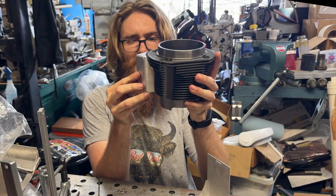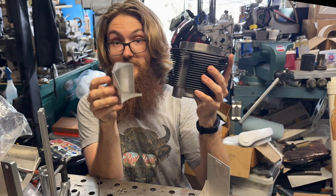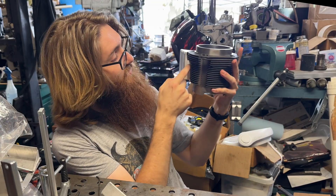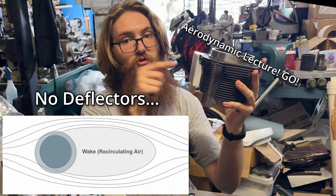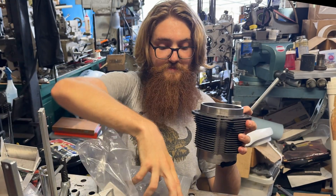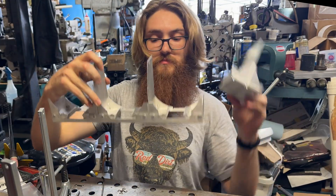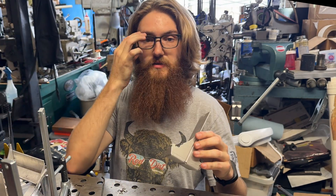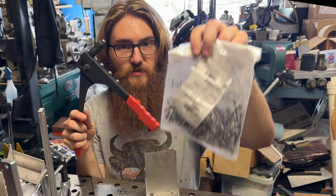This one instead contours to it very nicely, making sure that the air stays redirected up into the bottom fins at the bottom of the cylinder. Once it's all tucked in, it's very nice. I am going to assemble one of these and I'll show you how I get from individual pieces to the full thing with the brackets and everything. It's quite simple, but it's a lot of drilling because I haven't put holes in any of these for rivets — I'm using a handheld rivet tool with 3/16th inch rivets.